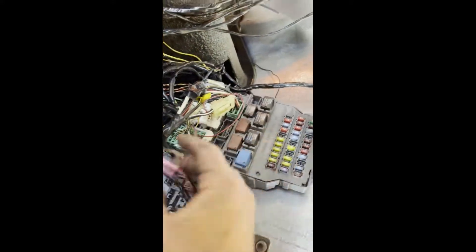We're definitely in luck here. Our main harness runs up, connections are made, and we've got our main connectors to the cables all connected. The fuse box — both fuse boxes — are now mounted and connected to the firewall, and we've made our first shortening splice of a line. Now we're going to slowly go through cutting all this mess up, shrinking it down so each wire is only as long as it needs to be to reach from its point to the fuse box.